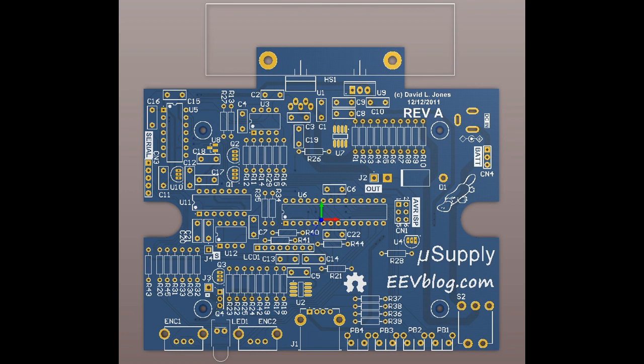And if this was just a board sitting in the middle of a case, and I then had wiring going out to the front panel and the back panel, then it would have been a simpler design from a system and a PCB point of view, because it would have just been a square board. There would have been no fancy cutouts. The mounting holes wouldn't have to be in specific locations to meet the supports in the case, and a lot of stuff like that would have been a lot easier.